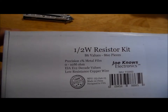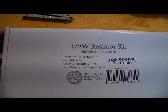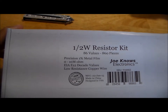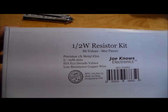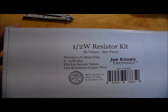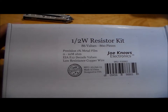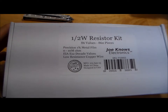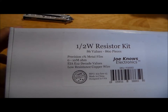You only need the half-watt resistors for lower values, up to maybe 47 ohms. In addition, I think an ideal resistor kit should also have some high-wattage resistors — here's a 1-ohm resistor, for example — maybe 5 or 10 watts. Because 1-ohm, high-wattage resistors are very useful in designing constant current for high-amperage power supplies, for example. So it makes no sense to have an entire resistor kit of one single wattage level. It's completely redundant past the first roughly fifth of the kit.